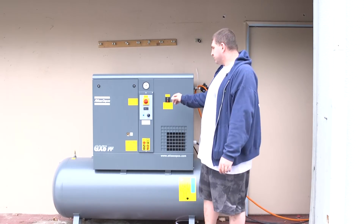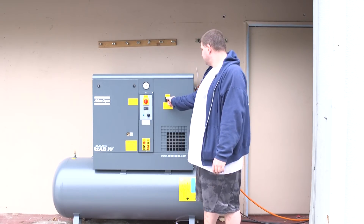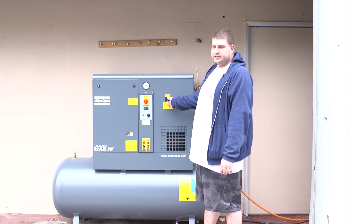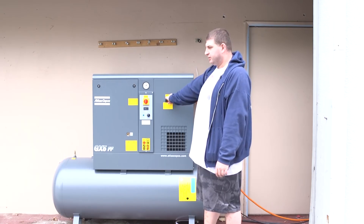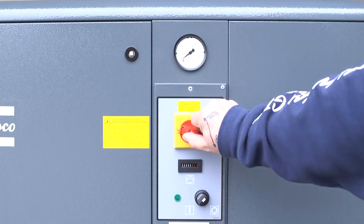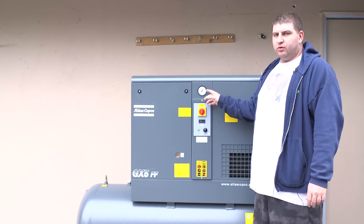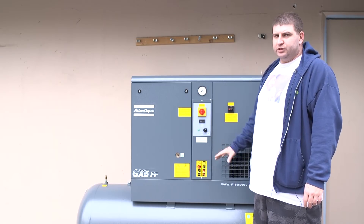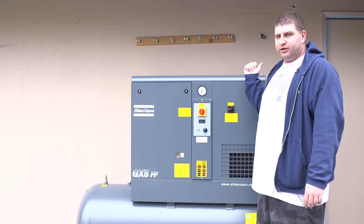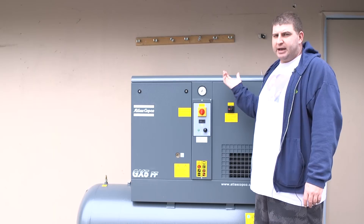Safety's first — we're going to turn everything on and let the system pressurize. We're using a CDA system to prevent the system from feeding moisture into the pump, which will make the pump run faster and cleaner. The compressor is set to sit at 150 PSI fully loaded, and then we're going to crank down the regulator to between 50 PSI and about 100 PSI. Usually you'll be around 60 to 90 maximum.